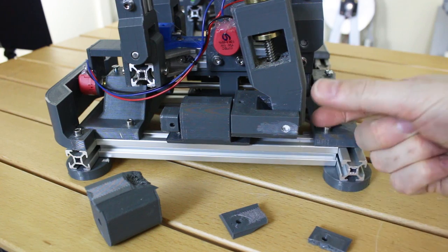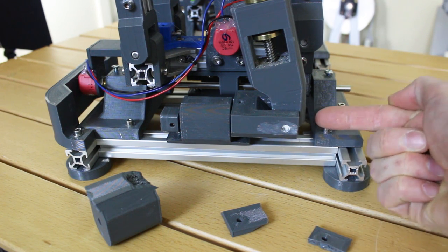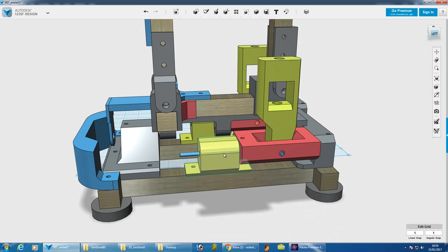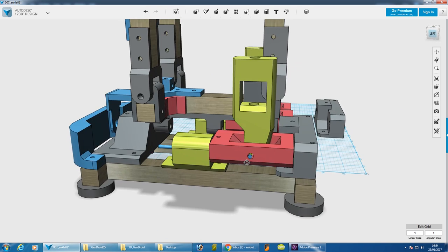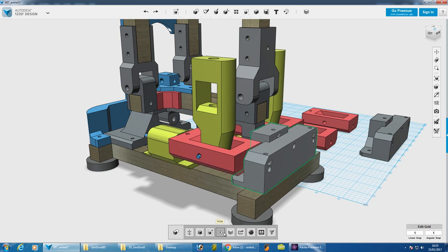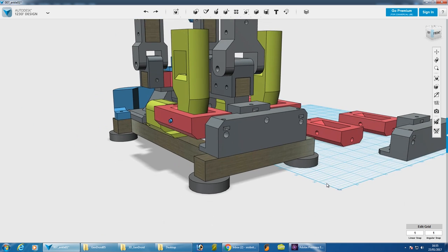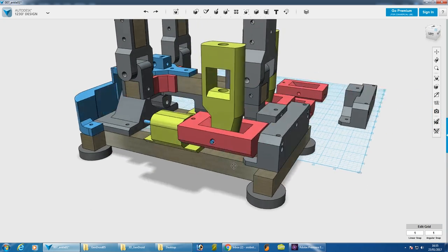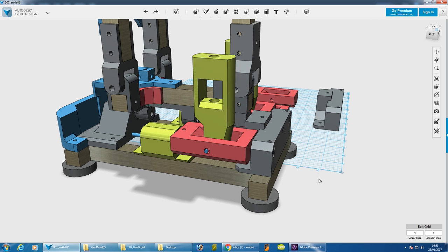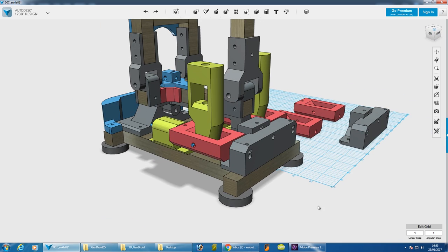What I really need to do is support this piece better — it rotates on an axis here with this end stop. I'm going to build a thing that comes around the back, supported on another peg. There are four of these, two on each ankle, and they pretty much take the whole load of the robot as this foot tips. My redesign keeps the front piece with the swivelling axis and stopper, coupled into the red part with a captive nut, plus another swivelling piece at the back held with 6mm stainless — that's the replacement heel, giving free movement in two axes.